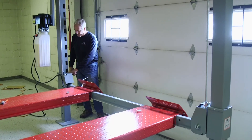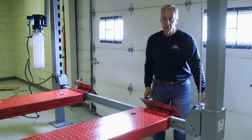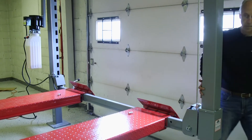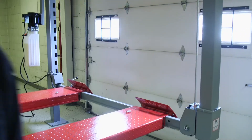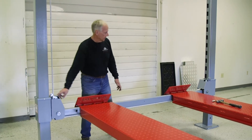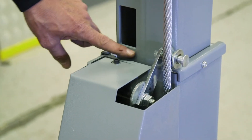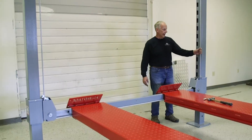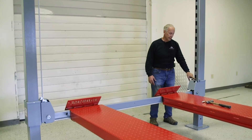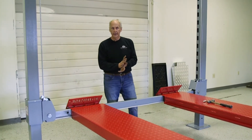So when this is flush here, I'm going to walk over to the other side and look — this one is flush over here too. Then we're going to walk to the other two in the back and make a note. This one is flush. This one is 3 quarters of an inch below being flush. So that means I need to tighten this nut at the top up by 3 quarters of an inch, bringing this up to where it's flush, and then all my locks will fire together.